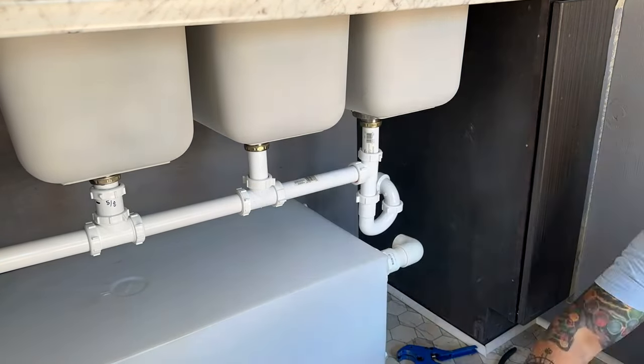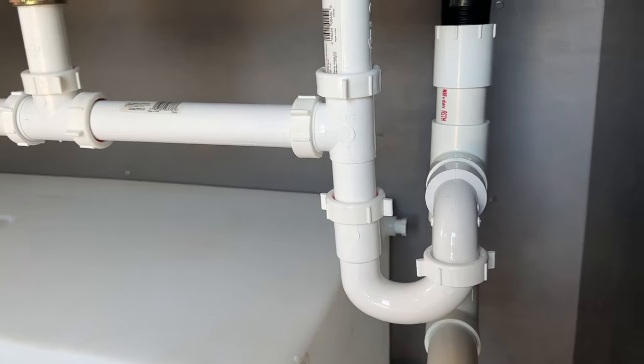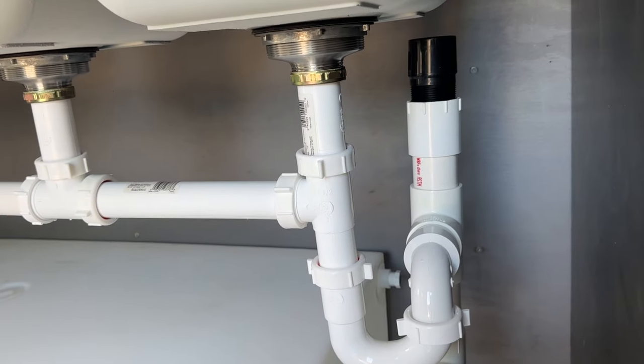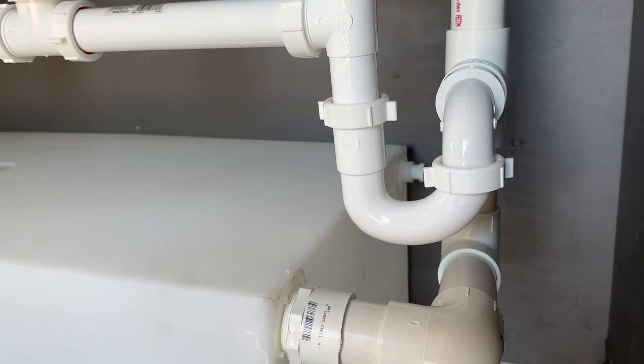You'll need one and a half inch threaded adapters to fit one and a half inch threaded pipe to one and a half inch Schedule 40 PVC. P-traps for the espresso machine and bartender rinser — for that you'll also need a dishwasher tailpipe, braided vinyl hose for your espresso machine drain, and braided vinyl hose for your water inlet. Most of the time those hoses are required to be food-grade. You'll also need a vent, or possibly a Studor vent if your code and regulations allow for it.